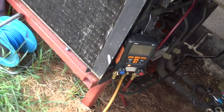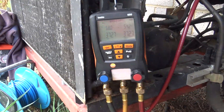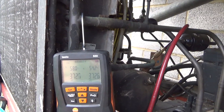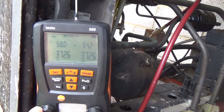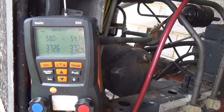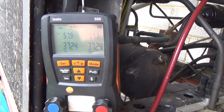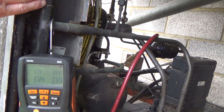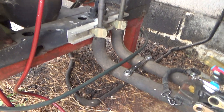Right, system holds about 11 kilos and we've took two and a half out - or 2.4 - so it's lost a fair bit. I've put 400 PSI in here about 10-15 minutes ago and we're down to 370, so unless it's leaking past the valves. I've only put it in the condenser, the receiver, and the hot gas pipework.